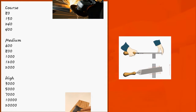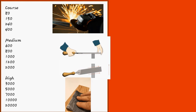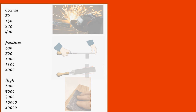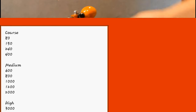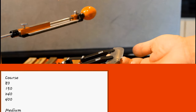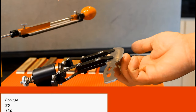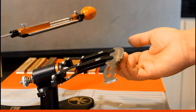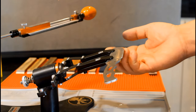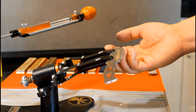With coarse stones, it is not difficult to determine if the burr is complete from tip to end. There is no reason to purposely make a huge burr. As soon as you can feel it, that is enough. The larger you make the burr is directly proportional to the amount of blade material you have just wasted. In fact, as a beginner, you should practice on your mother-in-law's kitchen knives. Once you get the hang of burr making, then try sharpening your own kitchen knives.